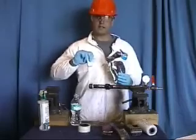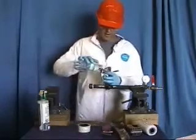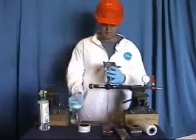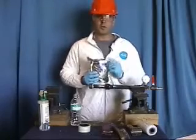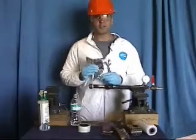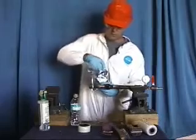There's our Cento glass outer composite sleeve. Fill the pouch with water, activating the resin. We're going to allow it to sit for 15 seconds submerged in the water. I'd recommend using cool water, which will elongate the cure. The warmer the water, the faster the cure. Remove the composite wrap from the water.